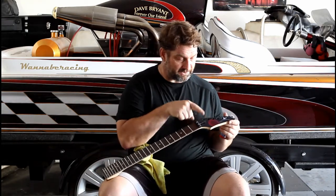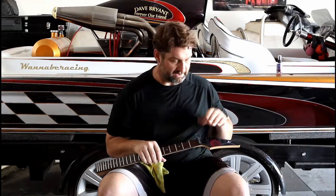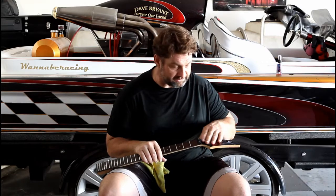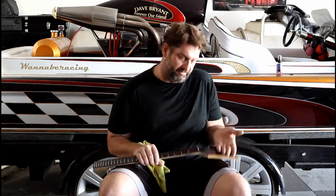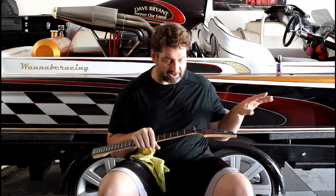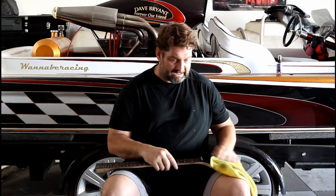That was pretty quick, but I hope it helped. Also, if you're looking to sand and then polish your clear, let's say my clear is 48 hours old, and I want to sand and polish it, it's the same as a fret. You start with 800 or 1000 till it's nice and flat. Then you go to 1500, then 2000, flip your 2000 upside down, you're going to start to see it polished. Then go to your automotive store and get a polishing compound or a rubbing compound and use that. Buff it up and you'll get a real nice mirror finish.